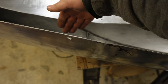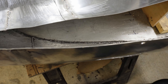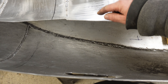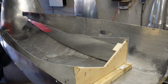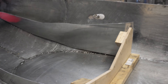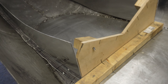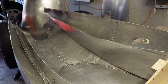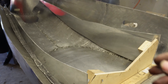I've got to fill the sides in, so I'm going to weld that bolted in. I'm going to order a whole load of M4 nuts and bolts because I think I'm going to have to start with panels that go down with 90-degree edges and bolt them up. So I made some cardboard templates of the sides — really difficult because you're dealing with lots of different curves — then I did them in aluminium, using tiny bolts in about four places along towards the tail. Then I'll put the centre section back in and put the whole lot back on the car to check it still fits.